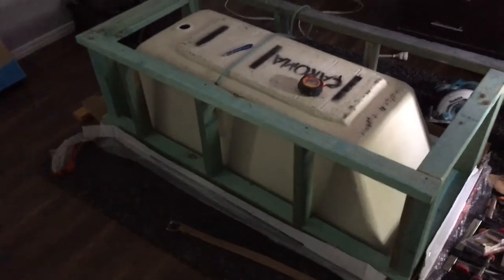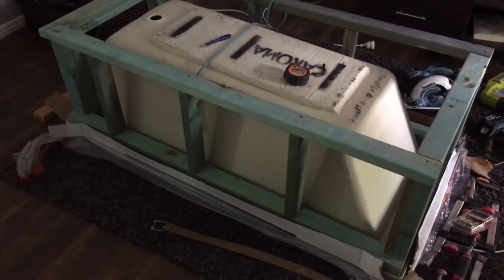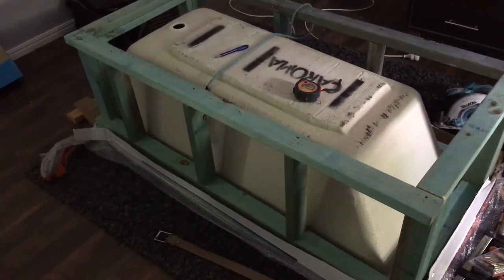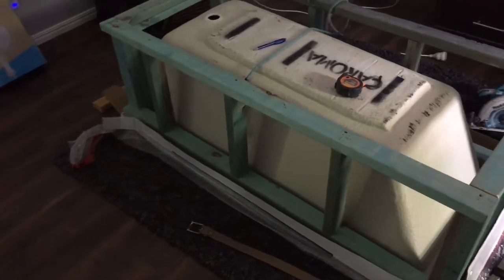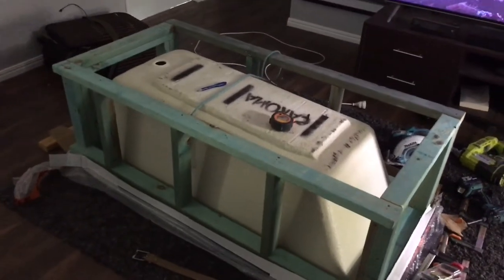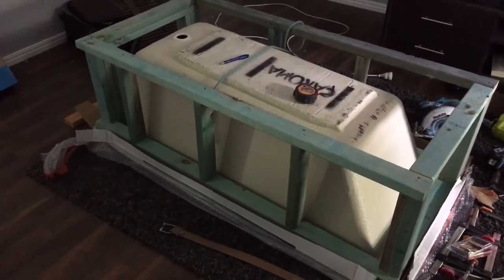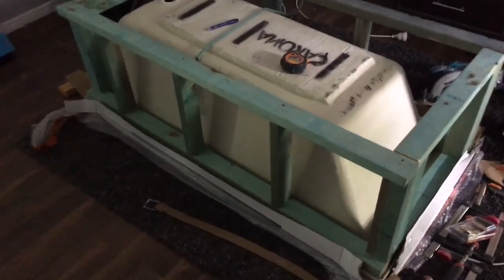That's how I built a bath enclosure — there's probably 50 other ways to do it, but that's the way I did it. I'll put it in and because we've only got one shower, I'm going to install this, sheet it up and waterproof it, and then put a temporary shower above the bath. That way I can pull the shower out and do the shower area properly. I'll probably just leave it waterproofed and shower with the blue waterproofing wall. Anyway, cheers, thanks for watching.